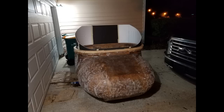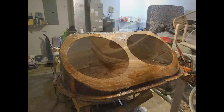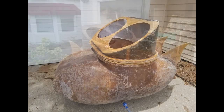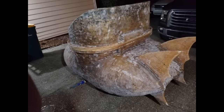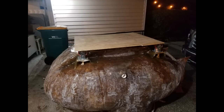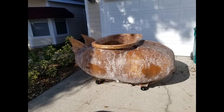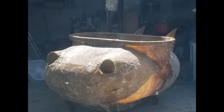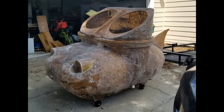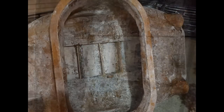The same basic process was repeated for the canopy section, but for the front face of it, I used a plywood sheet and covered it in several layers of glass to isolate it from the water so that it didn't rot over time. The holes are 21 inches in diameter and will be used to mount the window domes. I then added the tail fins for a little bit of directional stability, but mostly aesthetics. After that, I mounted 4-inch casters to the bottom of the hull, because the sub wasn't shaped right for a regular boat trailer, so it would have to be winched on and off a regular trailer at the boat ramp. Halfway into the build, I decided I'd want headlights for night diving, but I wanted them integrated into the body of the sub, so I made some cutouts and attached mounting points for the lights recessed a little bit into the curvature of the hull. Then I thickened up the bottom and added stiffeners, because this was where all the heavy ballast was going to be carried.